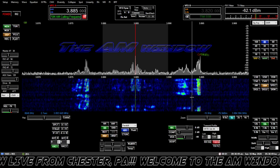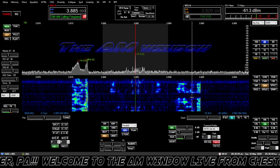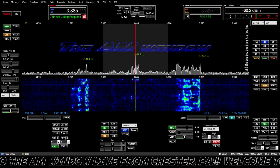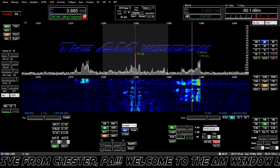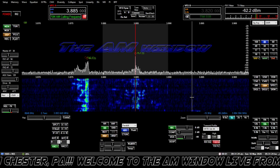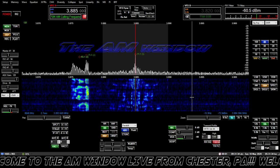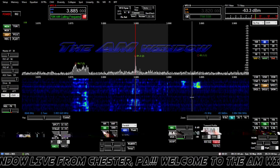I took out the, I had one of those, what was it? It was just a small motor. It was a CDE, Charlie Delta Echo rotor is what I had on the log periodic before. And of course, it was one of those CD45 rotors that does not have a brake. So, you know, that being the case, even when the wind would just slightly blow up here, that antenna would just whip around wherever it wanted to go. And of course, south was where the stops was on the rotor. So the wind was just constantly banging the rotor onto the stop.